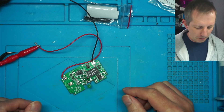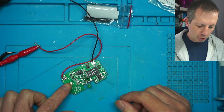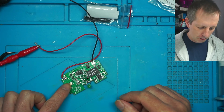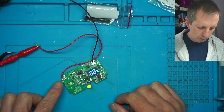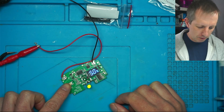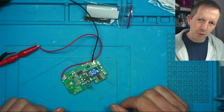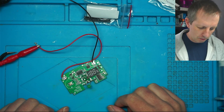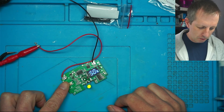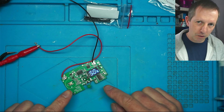Oh, it's looking good. If I press this button, that should switch the motor on — the LED should come on. And it does! Is it going to turn off? And it does. So it's not a PNP — it's not a P-channel MOSFET. It's an N-channel MOSFET, and I think it's fixed.